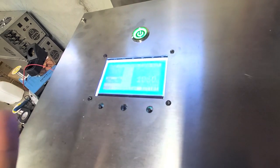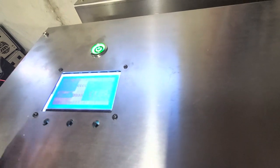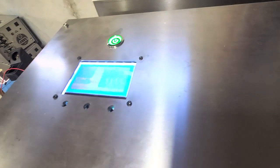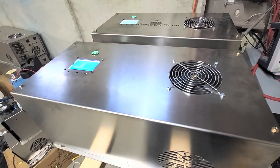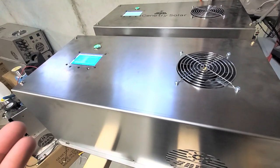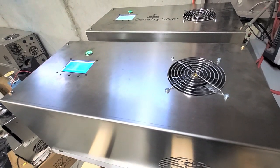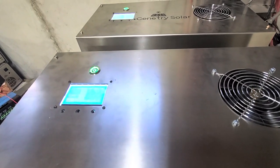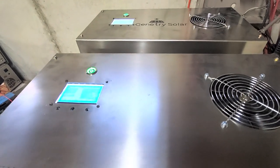But I wanted to give you a video to actually show you that it is working. The important stuff — like the central air — is in fact running on these two inverters at the exact same time. These two inverters are pushing that compressor and that furnace blower motor right now to cool the upstairs of the house. It takes the 77-amp surge on the master inverter, then the slave kicks in and starts to help with the continuous loads.